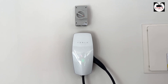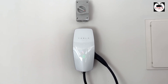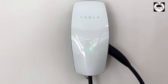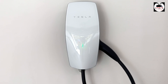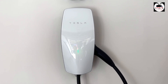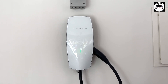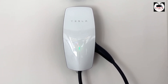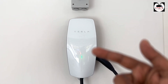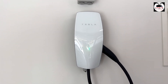In my case I do have the isolator on top. I think it's a good idea but I heard recently from an electrician that here in Australia you may not need an isolator — check with your electrician before you install. Tesla gives you an option of changing this wall connector by yourself if something goes wrong or if it becomes faulty. It only has four screws — two on top, two at the bottom — so you can remove those, take this out and replace it with a new Tesla wall connector. If it's under warranty Tesla will probably replace it for you. That isolator would be of value because you can switch it off, remove the four screws, and swap it out.